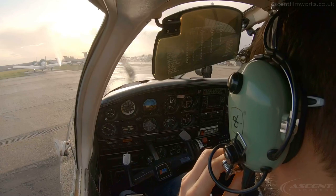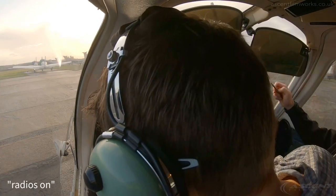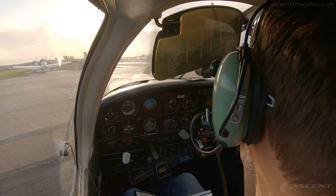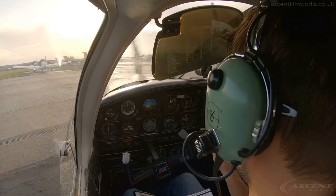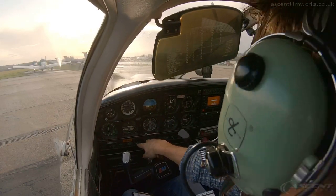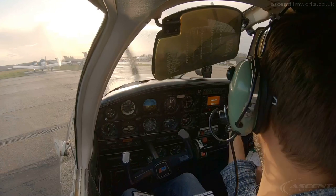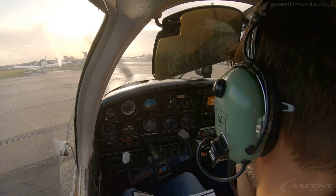Can you hear me? Now you should be able to hear me. Loud and clear. Did I miss that one earlier? No, so that is radios down there. Okay. What about the warning light? Is that out? Ammeter? Yeah, it's on. It's very low. Positive though. Suction is over here. It should be between 4 and 5, is that right? It's about 5, 4.7 at the moment.